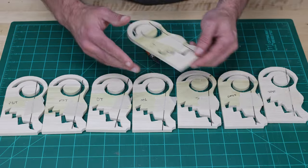Next was the precision ground tooth blade — there are a whole lot of subcategories to that, so based off just the one that I tested, it came in number two. Number three was a tie between the crown tooth blade and the double tooth blade, which kind of makes sense — both blades have teeth that are really close together, they're both really slow cutting blades, and they're both made to get a clean cut. Then rounding out, we have the skip tooth blade, the double reverse skip tooth blade, and then last was the spiral blade. Now there's a purpose for all of these blades, so even the ones like the spiral blade that came in last, there's definitely a specific purpose where that blade will perform great. My biggest takeaway is that I have been using the reverse skip tooth blade and I'm glad that I am. I'm going to keep using that blade, but I'm also going to go find a number five crown tooth blade and see how that does on a couple of my future projects.